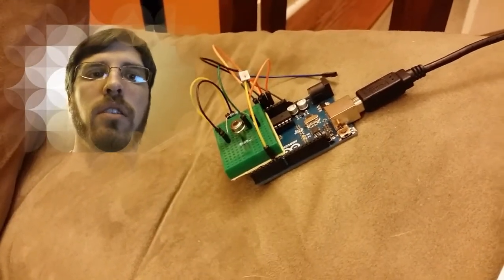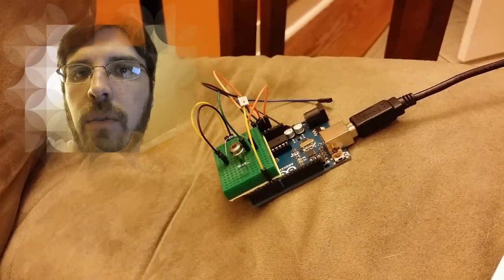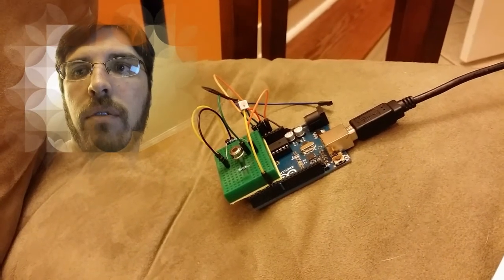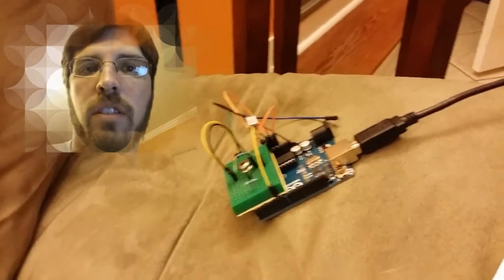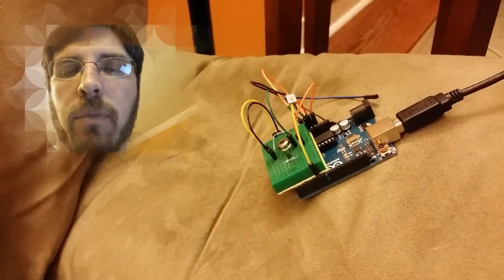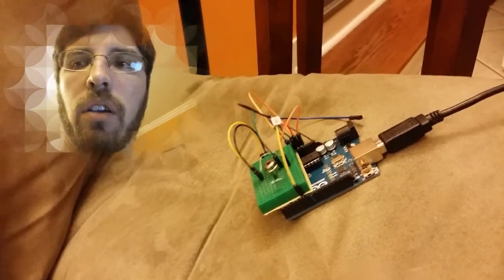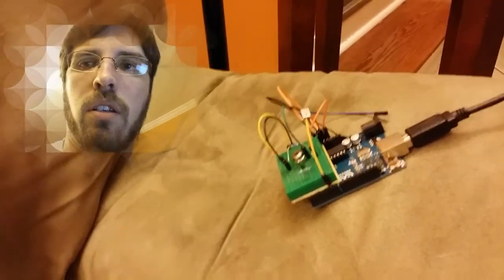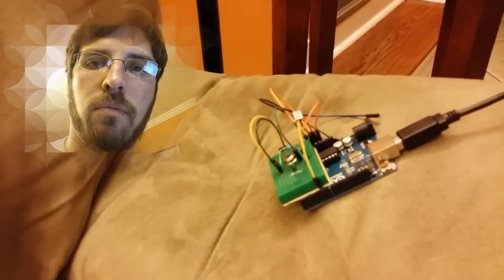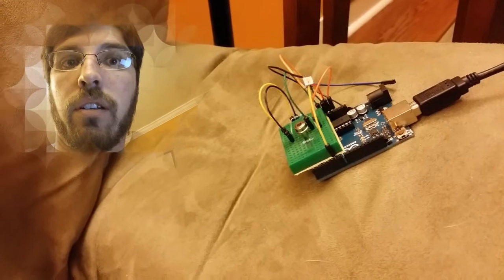So anyway, this code is using some logic and code I worked on with Dustin previously, that's going to generate an array of saturated colors. I think it's a 512 array. I couldn't fit too much more. Arduino doesn't really have a ton of memory. On the lower end of the spectrum, like the 1, 0, yada yada, it starts at saturated red and goes through all the primaries, red, yellow, green, and at the high end, at the 512, it ends at magenta, because I didn't want it to loop back around to red, because that'd be a little confusing.